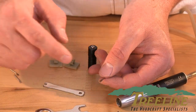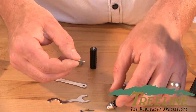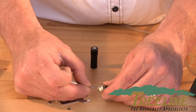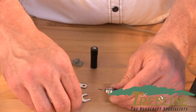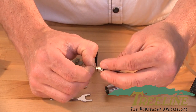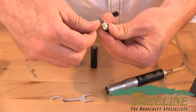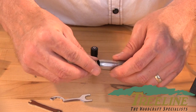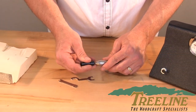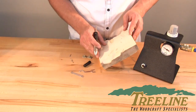That's what you want to clean. Take that collet and rub it with rubbing alcohol or something that's not oily — a metal cleaner that's not oily — and clean that up really good. Then when that's good and clean, go back and assemble it by putting the collet in first. With the guide bush around your bit, push that in place and then put the chuck nut back in there. Line it up and do everything by hand first, then go snug tight with the chuck nut — you don't want to over-torque that, just snug tight. Line it up and put it back into the hand piece. Do that about every 40 hours of use and it'll allow the bit, the tool, and the cartridge to last much longer. With that, we're ready to flip the switch and do some carving.